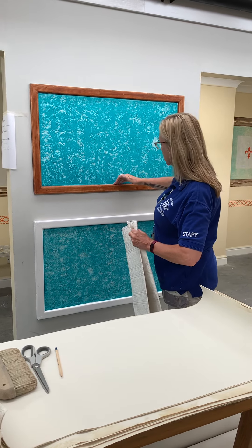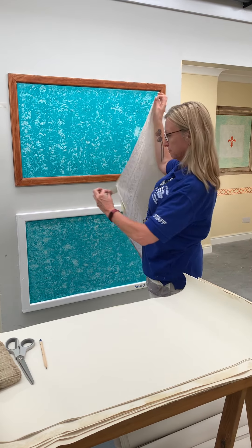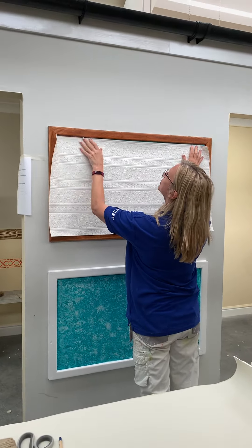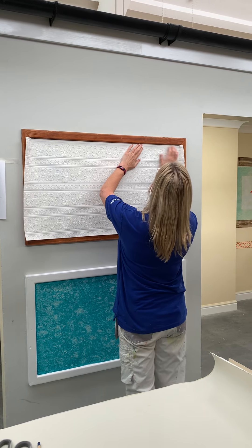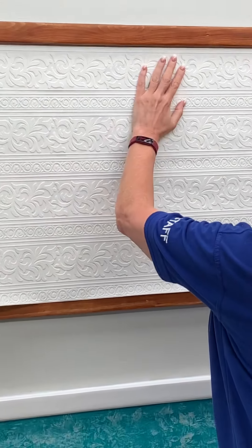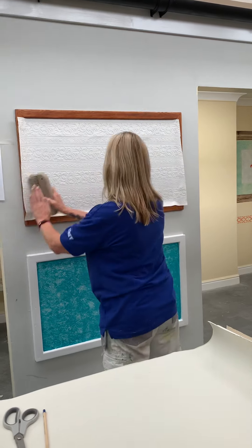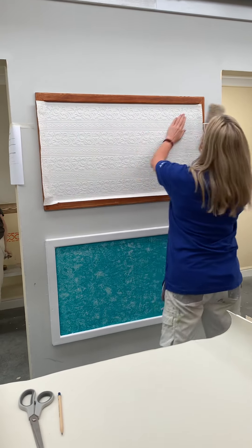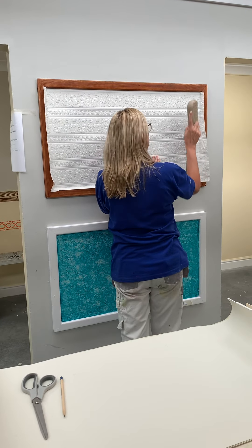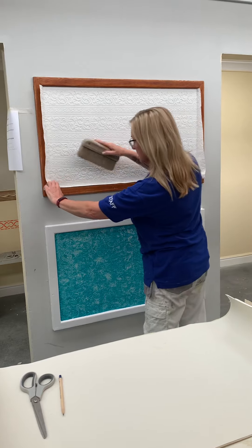If you're hanging horizontally, you can hang it to the bottom or the top; if vertically, hang it to either side. Unfold both sides and take it to your panel — get it positioned so the top of the paper just touches the top of the frame. It doesn't want to overlap, and it doesn't want to be down — it wants to be touching. Put your smoothing brush from the centre out to the sides, brushing all the air out. Check it's not coming away from the top, then tuck it into the corners with your smoothing brush.